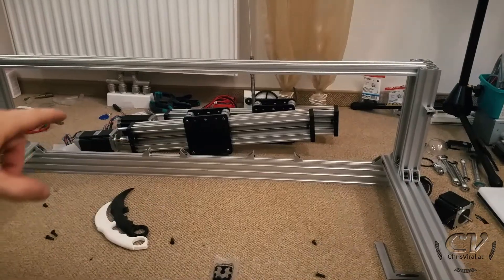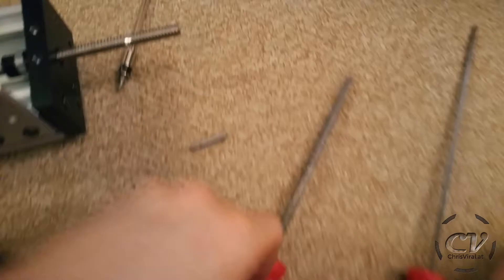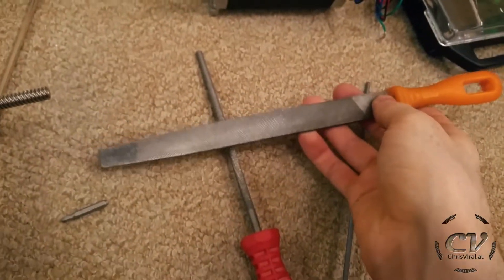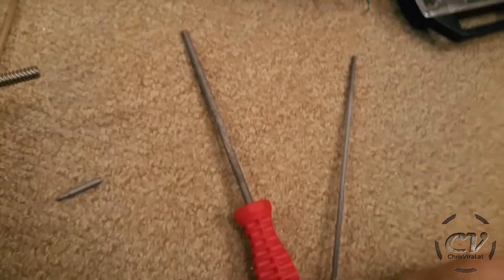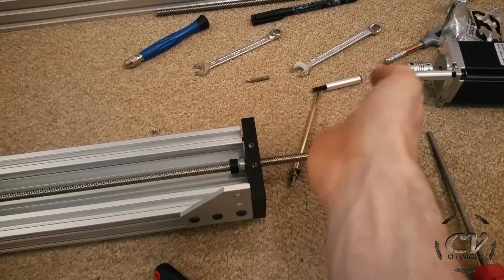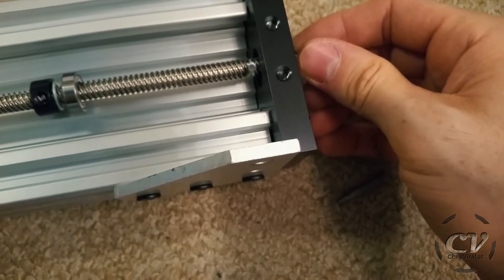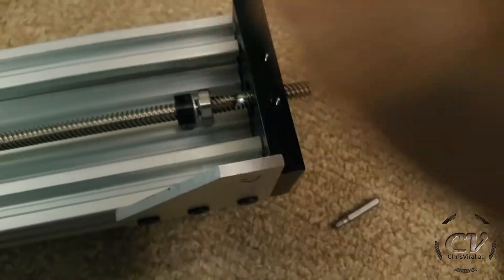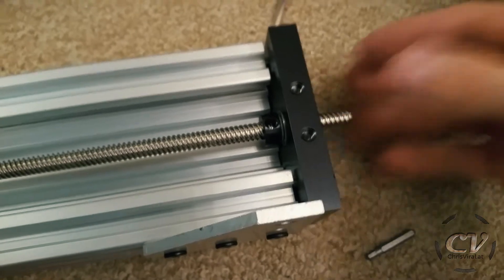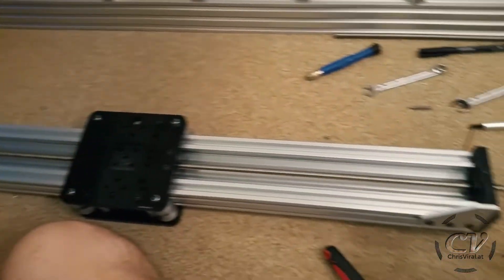As you can see, I'm already done with the y-axis. That's the gantry x-axis, and I'm actually able to file off this section. A very helpful tip is to file like that, because this will make the fitting process very easy — you can position the lock fairly precisely. I'm fixing it in place and then screwing it on, which gives it pressure in this direction and bends it slightly, but this way there is no play.